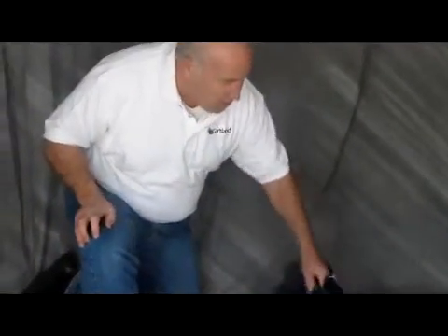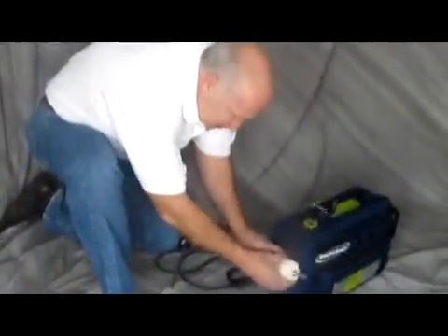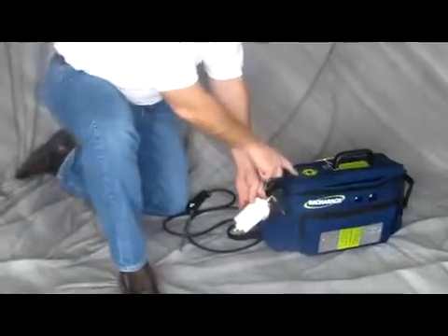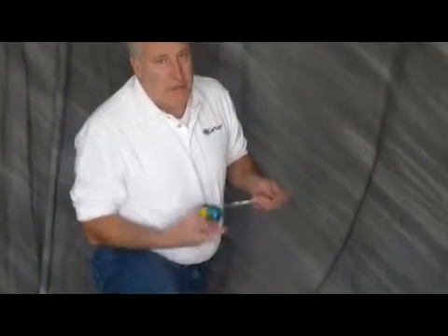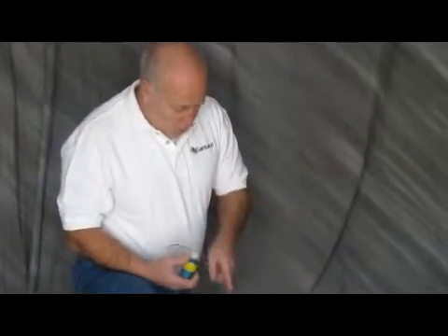On this side of the unit is your clean air draw system. Every so many minutes, the Bacharach unit zeroes itself out. How it does that is it gets a fresh air sample through this charcoal filter, brings it in, and the display will say 'purge' as it's doing that, then it zeroes out. That helps with the sensitivity of the unit. You may have an old style filter, which is right here — it does the same exact thing, however it is not going to give you as long a life, and Bacharach is not providing these anymore. So if you have this old style filter, the next time you get one, you're going to get the big one — it's going to last a lot longer. If you do have the old style and go to the new style, you're going to want to get the whole assembly. Just let them know you're replacing the old style with the new style. This part is not very expensive at all.